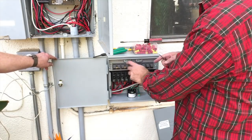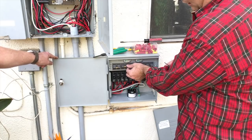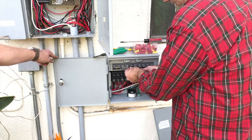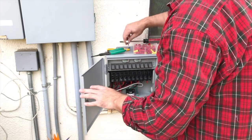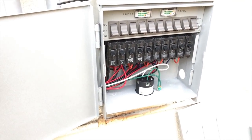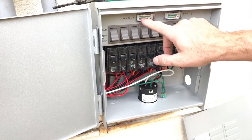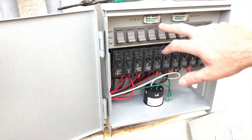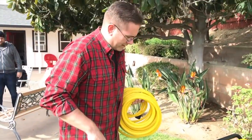I think it's time we give this a try. Zach pointed out I forgot to take these little connectors off. The panel comes with these so the two will operate as one switch for a double-pole situation — there's just a little screw here. I'm going to put these all on the line position, like power is on right now. What about these meters in here? This is how we're going to tell how much is being pulled from each load — these show watts. I've got a 7,500-watt generator, so those numbers kind of add up. We'll be able to see how much is being pulled on each side.